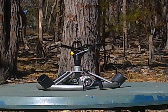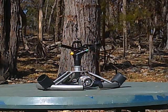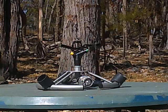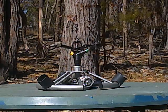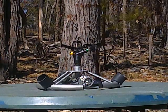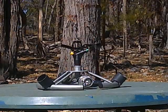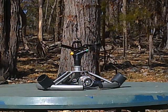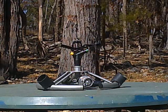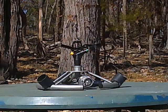The outside of the circle is watered by the 4.9 millimetre green jet, and it, as you can see, leaves the sprinkler at a 30 degree angle to the horizontal, and it comes out quite fast and it goes in a ballistic curve and it lands at about a 30 degree downward trajectory, assuming you've got a perfectly flat level piece of ground to water.